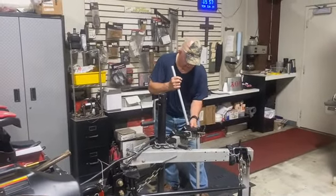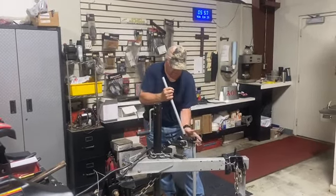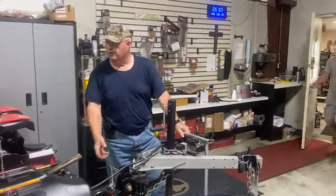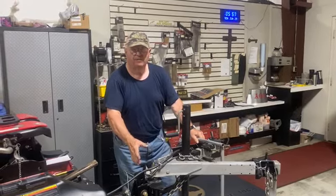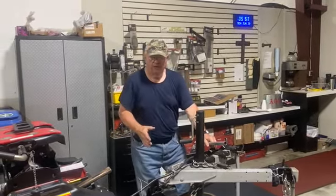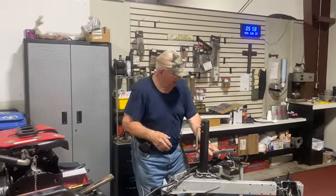Sometimes people forget, and they get where they're going, they're tired. So they put the block of wood down, uncouple their jack, and jack it up to 4 inches, and yeah, it comes with it. When they unhook that first bar, boof, it drops out of the jumper. Now they've got all kinds of weight hanging here, there, and everywhere. There are just a number of things that can go wrong if you're not paying attention.